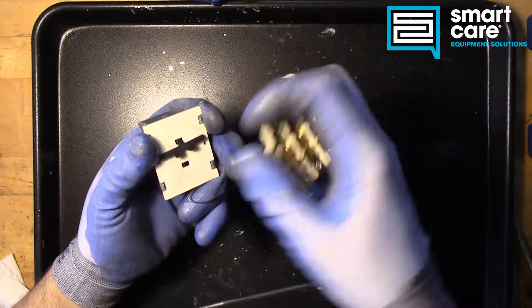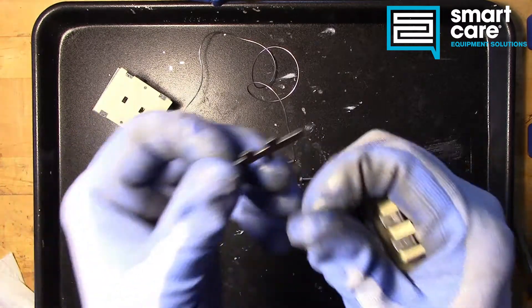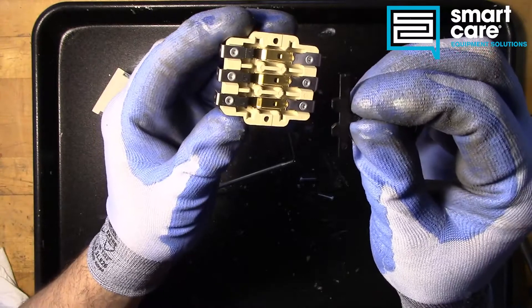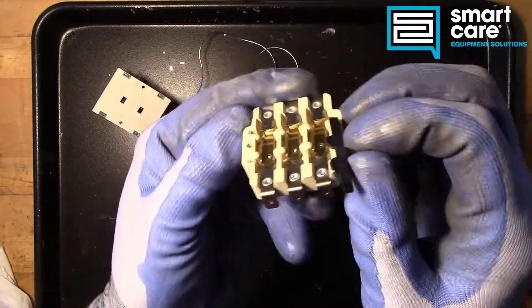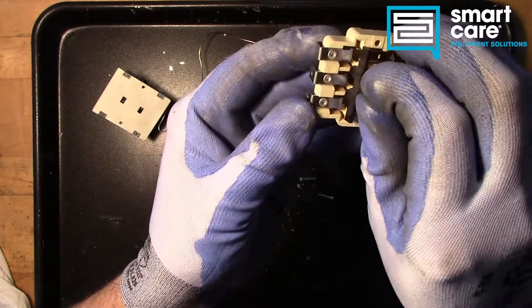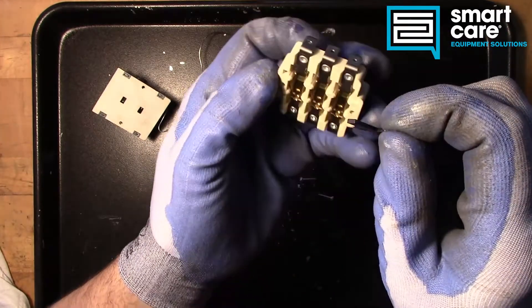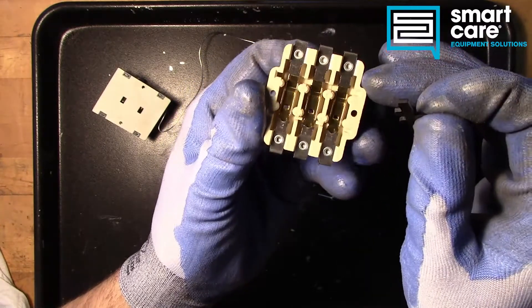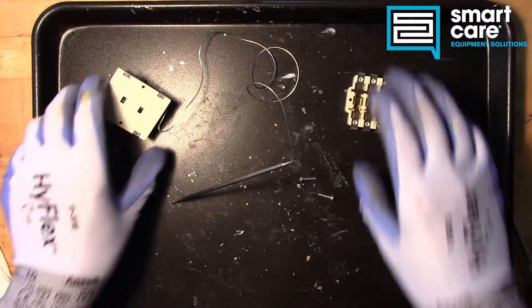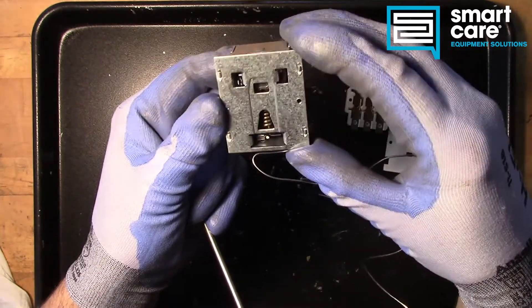Here are our electrical contacts. You can see two pieces fell out when we opened it. Inside, this small plastic bar pushes down on each of the terminal connections. These go to a normally closed position with no external force — so when the switch is reset, it's not pushing, and when it trips, it opens. Any grease, oil, or contamination that got in there could potentially interrupt those contacts, cause high resistance, or cause them to corrode.